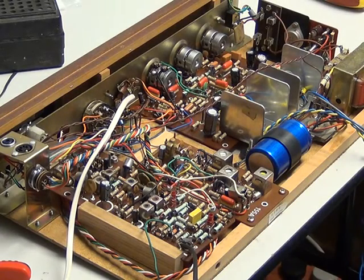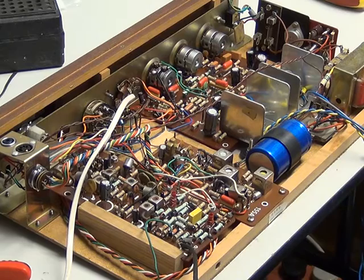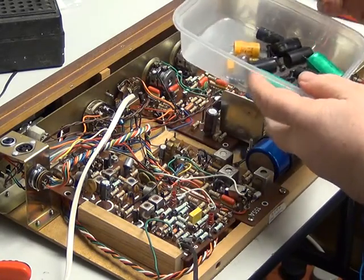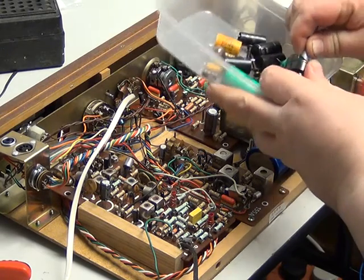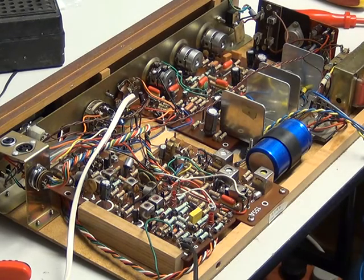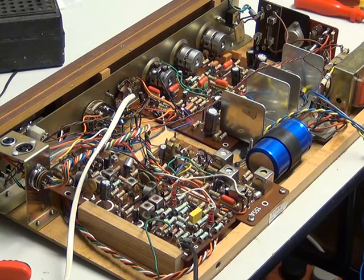We've got to the stage now where this is working again. So we'll change the on and off switch. The original one is open circuit on both poles — it's a double pole switch. Clicks all right but doesn't work. We did just have to drill out with a cone cutter as it's slightly bigger shaft than the previous one. These are D shafts, not just round shafts, so I had to file a D into the shaft. It's a plastic shaft so it wasn't difficult to do — otherwise the knob wouldn't have fitted in the correct position.